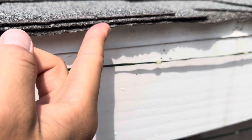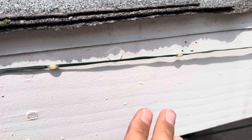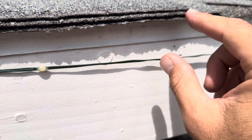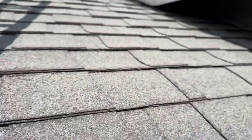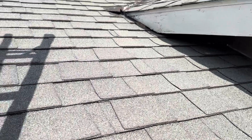Working up to the top of the roof, we have some old school drip edge. You can see how small this drip edge is, but it does still help — it allows the water to run off this metal as opposed to running directly off the wood, so it does help preserve the wood. When we redo this roof, we're going to add more to this drip edge — put some new two-inch drip edge on there just to make sure it works a lot better than the older product that's on here right now.